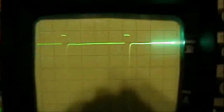Let me display that at 20 volts per division — that should give us a little bit greater signal. There's a decent triggered signal. What you're seeing there is a brief 12 volt turn-on, and then when the transistor turns off you get a massive negative-going spike. The magnitude of that spike — remember we're at 20 volts per division — and it's off the screen down below. That's why the neon is flashing so brightly, and that is what will destroy your transistors if you have a reasonable amount of turns in your coil and you don't put a safety neon in there.